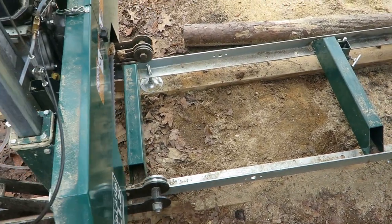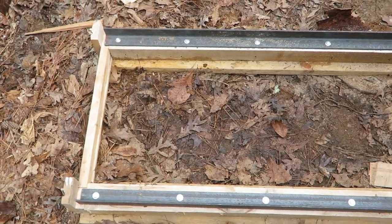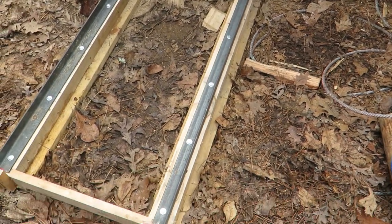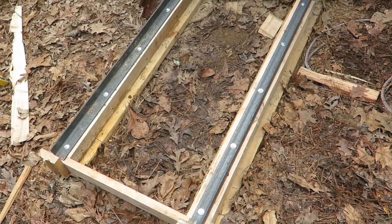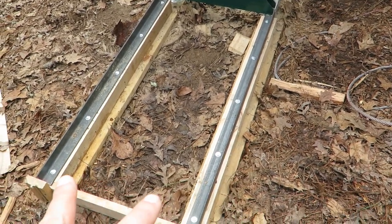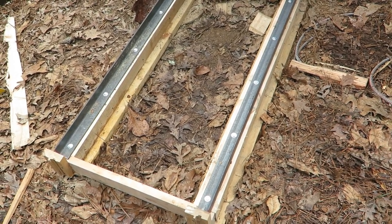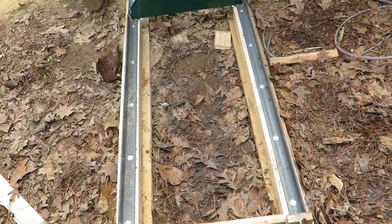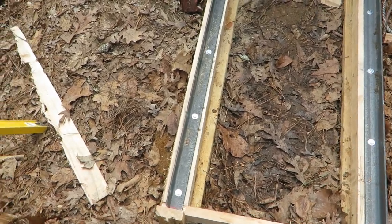It's not a major change as far as being difficult. What I did is, when I originally put the piers in, I had extended my piers out here four feet because I knew I was going to do this track eventually. I toyed with the idea of doing a hardwood track, but that just wouldn't work. So I went to Lowe's and picked up a couple of two-inch by two-inch quarter-inch angle iron — they run about $35 to $36 a piece. So with tax, I've got about $80 in it. Now the regular extensions are obviously better, but you're going to spend close to $400 for those. For what I needed, I thought this would work fine.